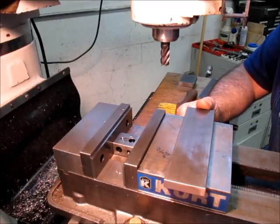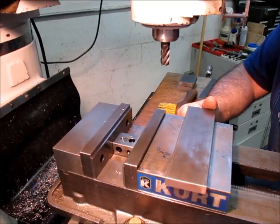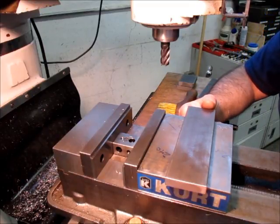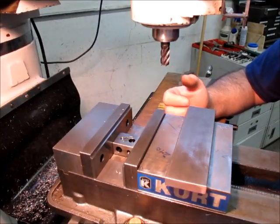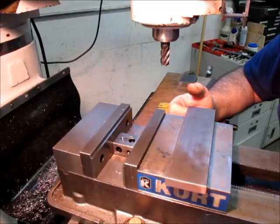But if you have lots of metal removal or lots of roughing to do, it's important to know where the limits of your tooling are and your work holding. Now, you don't want to flip a 2-ton rotor out of a lathe, so you're going to be fairly conservative in those situations. But where you have good work holding and good tooling, these machines are pretty amazing what they can do if you'll let them. For hobby guys and risky or expensive work, yes, you're going to be very conservative and nibble away at these things very carefully, and not risk chucking them out of the machine or climb milling and having the thing snag and do something unpleasant. We'll just call it that, unpleasant.